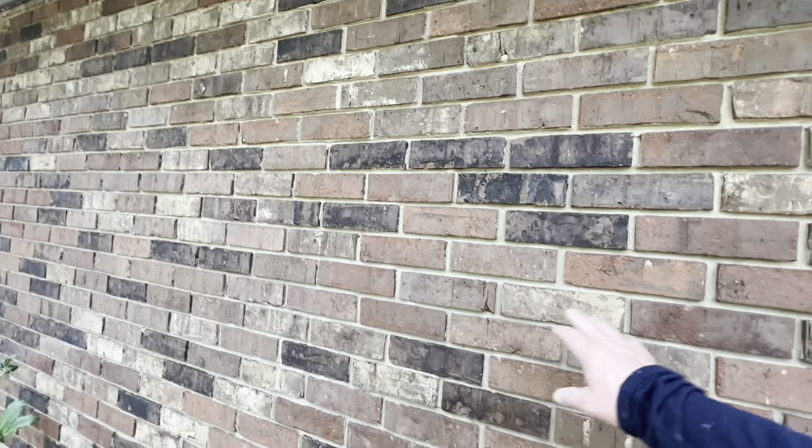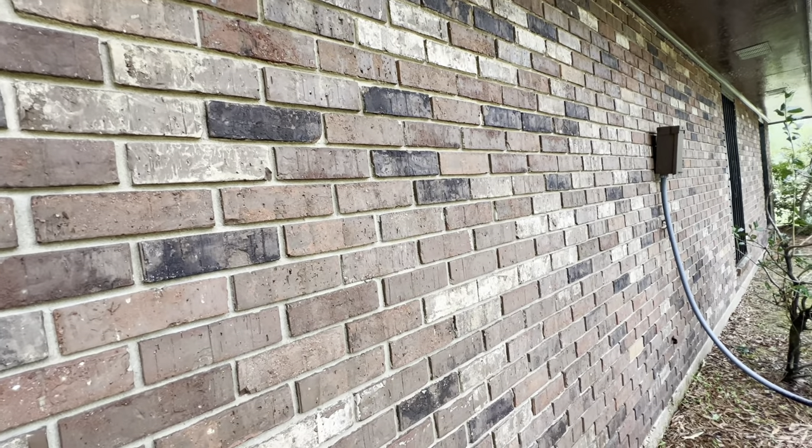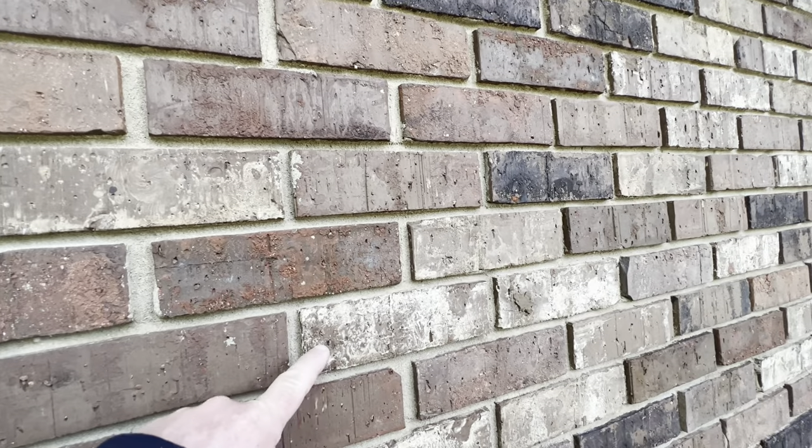On this brick we can use a little PSI. On the wood or vinyl parts, we're going to use about 50 to 60 PSI — a real soft wash technique. On brick, we can go two, three, even four hundred PSI to remove some of the buildup. I don't advise anything over about 1,000 PSI on brick — and honestly I think 1,000 might be a bit too much. I tend to keep it well under 500 PSI. Especially on older brick, you can mess up the mortar joints or remove some of the face of the brick.